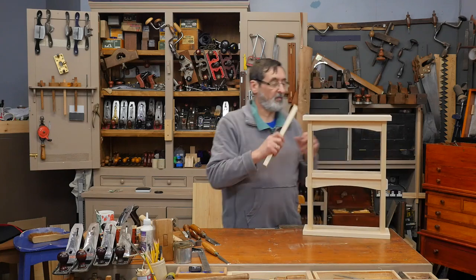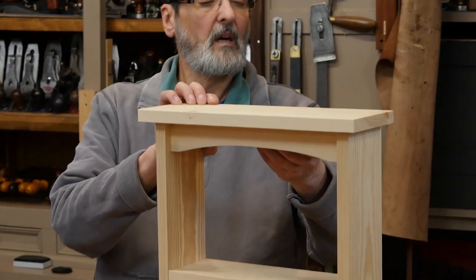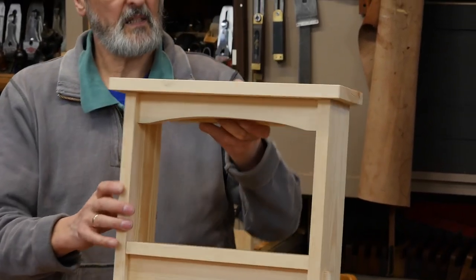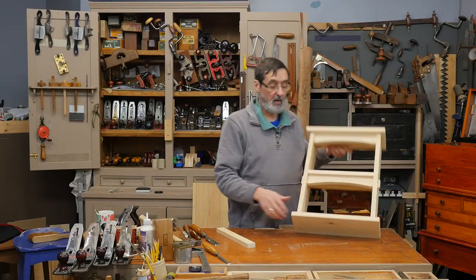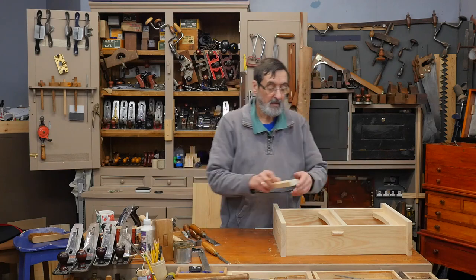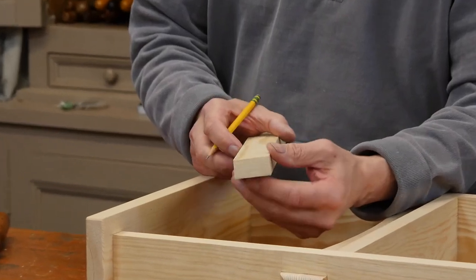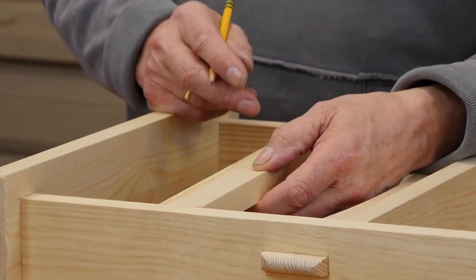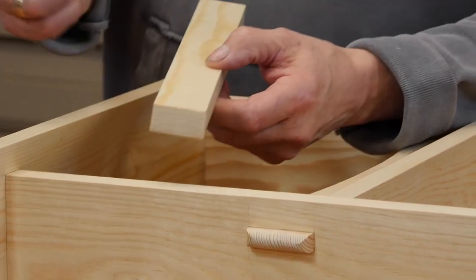Some of you have asked how you can hang the bookshelves to the wall like this. So we're going to take this cleat here and we're going to split it a certain way. And I'll show you the simplest way to do that. If you take a piece of wood, this is 1.5 by 3/4, and this could be 10 feet long. This is just long enough to fit right in between the two sides here. And generally that's what we do, and then it won't slide off.